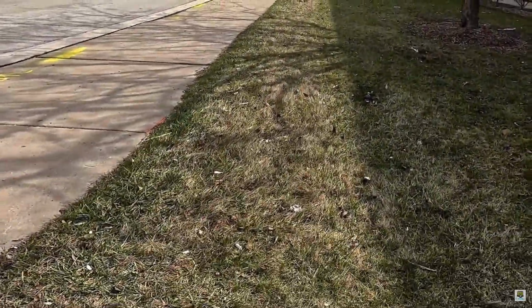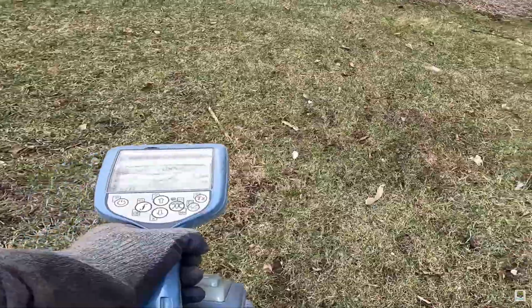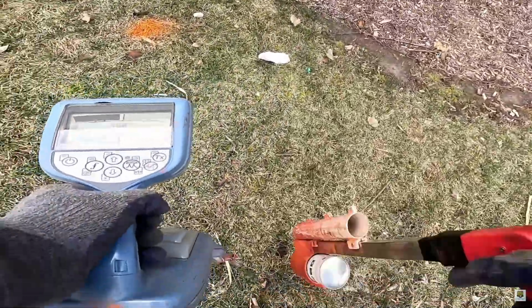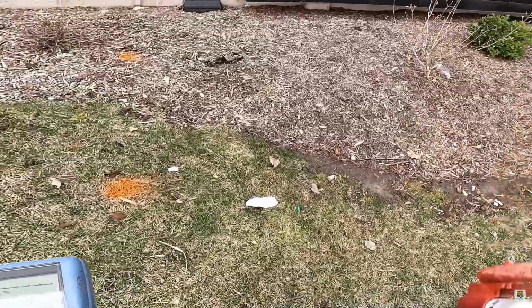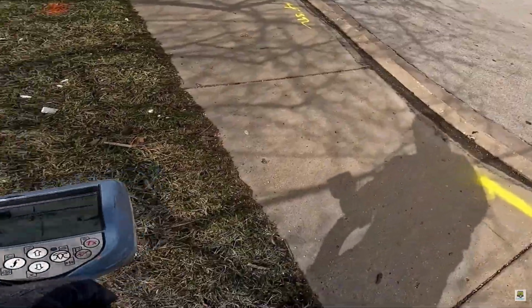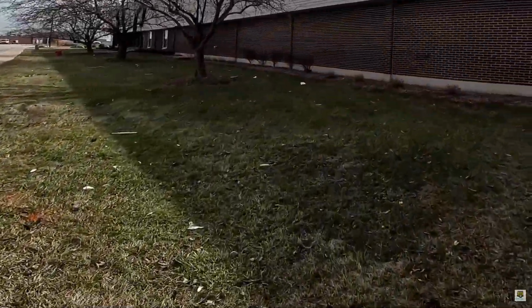So when you lose a tone like this, you don't get nothing. You need to do another 360. So I'm gonna do the same thing, walk around. I'm gonna complete, and I'll be like, well, okay, I got a tone here, 68 milliamps, 2 feet, but I gotta finish my sweep to make sure it doesn't go on the angle. So I can conduct my sweep until I hit my last good tone. So I hit my last good tone here. I know this is the cable, and that's the only tone I got, is this one here, so I'm going to mark it out.